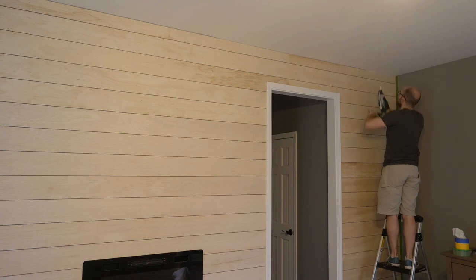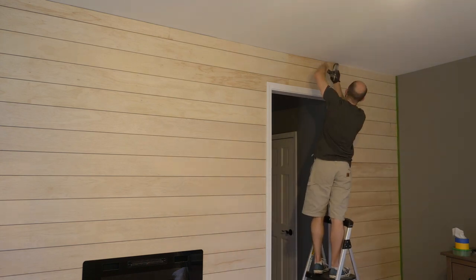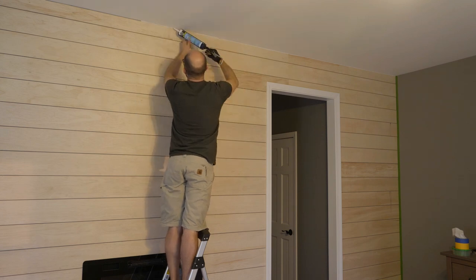What we have right here is the Patch and Paint by DAP. When caulking, I like to smooth out the bead with my finger rather than a specialized tool. I also wear a glove just to keep my hands clean, and after every section I clean my hand with a damp paper towel — that gives me great results.